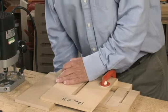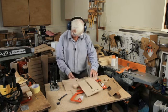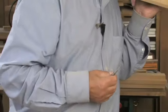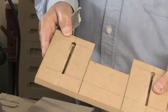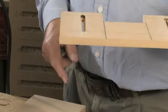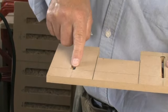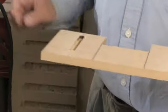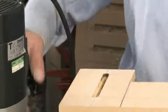I can remove this now and just clean the slot. You see — a perfectly symmetrical slot all the way through the material to take the shank of the screw, and a wider, shallower slot exactly symmetrical over the first one to recess the head of the screw. So when I'm using this, I can have the router base on there without fouling the screws that hold it.